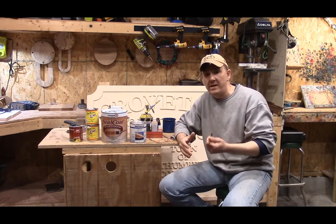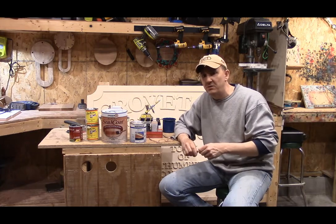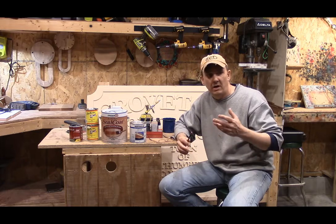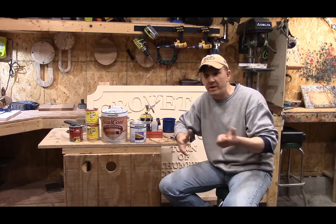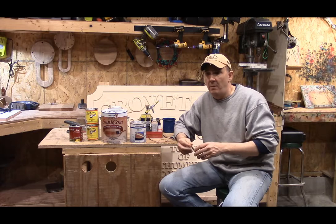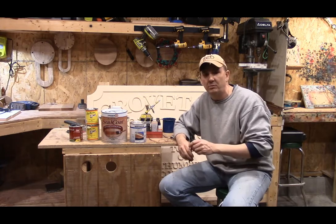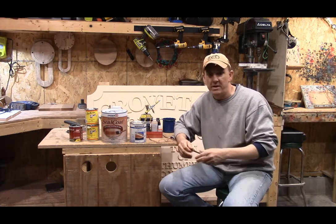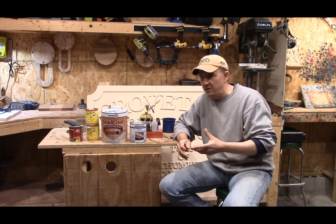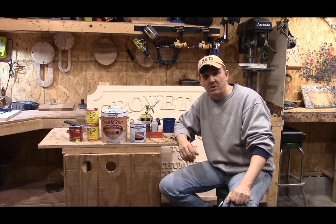The only thing I would recommend to any of you who are thinking of getting into signage: either talk to another sign shop about the products they use, or go to a professional paint store. Sherwin-Williams is a big one up here where we live. You may have something similar where you are. But what's applicable for me up here in the frigid, freezing upper Northeast may not be applicable to you living down in Arizona or southern Florida, where it's heat and humidity. Go to either a paint store that does this as a full-time business, or consult a contractor who paints for a living. One of those is going to be the best source.